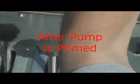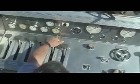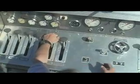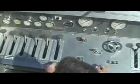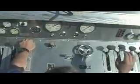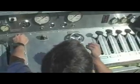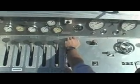Slowly open your deck gun. You can either use that or use the hose reel here. It's always a good circulation. You want to keep the water circulating through the pump to keep the pump cool. Always want to be running water with it if you are drafting, otherwise you can lose your prime and have to reprime and run this whole scenario all over.